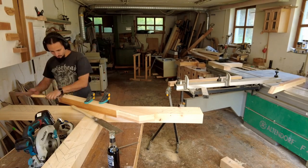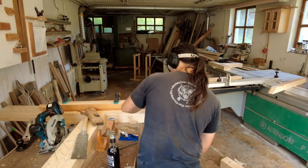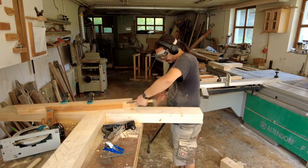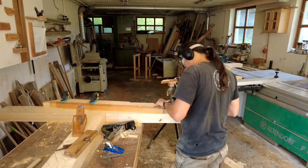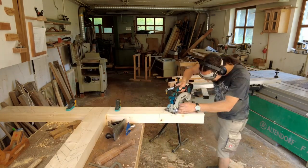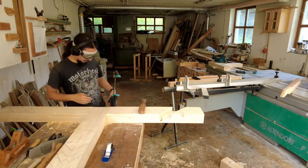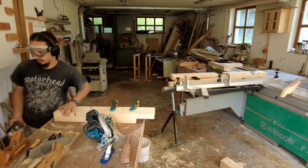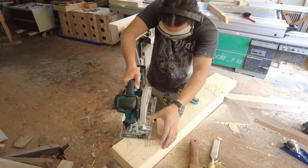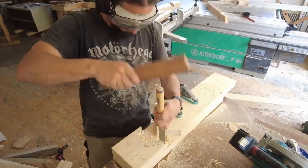Beams with the one-sided dovetail joints are also halved in the thickness so that they have overlap with the main beam. This way the main beam will not be reduced so much in its cross-section. The upper end where these connections join together is a little bit special. Accordingly, this was my solution approach to manufacture this.